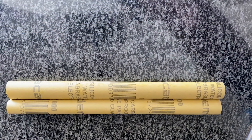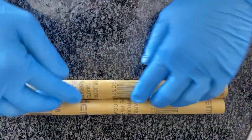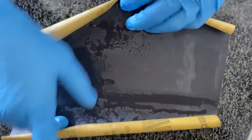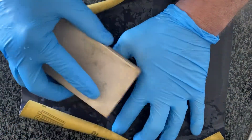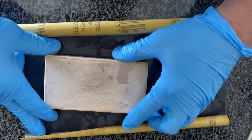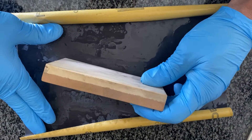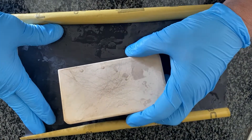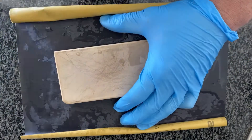The granite top is clean, this is a new sheet of sandpaper I've already wetted, and more importantly I've wet the surface and I'm sticking it on. Here's the stone we're going to use for demonstration purposes — it's an old vintage Rapport 6 — so we're just going to do this side to show you how I lap and also to finish the stone.